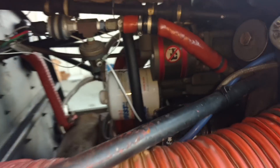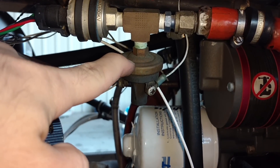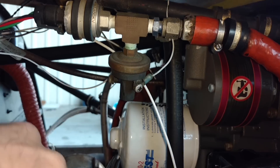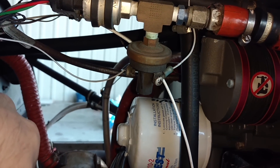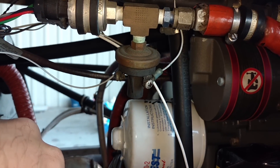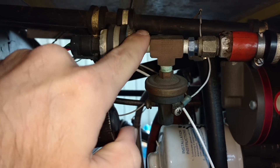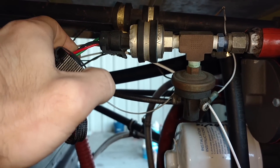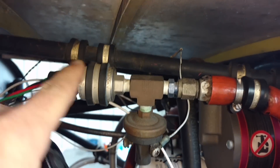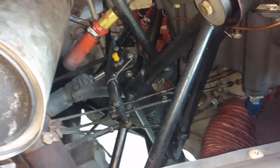Going back around, one last thing: we have this little line coming out here that comes to the most important part — a pressure switch. It trips at 4 PSI — as soon as there's 4 PSI of oil pressure in this oil line, we can see these two wires coming into it and going back into the cockpit. That is just an open-closed switch that runs the Hobbs meter. So if you want to save some money on your flight training, come out here before your flight, undo that screw, and the Hobbs meter will not work — that is the best advice I could possibly give you. Other things here: out of this T-fitting, these wires are for your oil pressure going to your oil pressure gauge, and some of these other wires are going to your temperature sensor inside the engine. This is your oil pressure switch which actually measures a numeric value of oil pressure and displays it digitally in the cockpit.